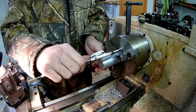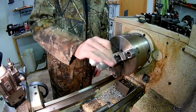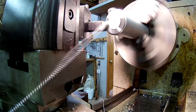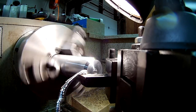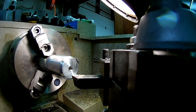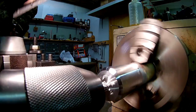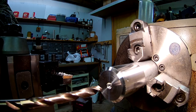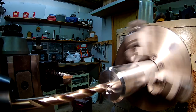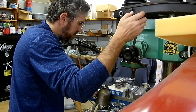I designed these swing arms out of aluminum and delrin. I wanted a two-part, easily exchangeable swing arm option. The idea is I wanted to try out some different swing arms, and having to weld them each time would just be a hassle. So this is kind of a quick disconnect, where I can easily make a new set of swing arms if I want to toy with it. I made the two end caps together as one, then sawed them in half to have two individual pieces made back to back.